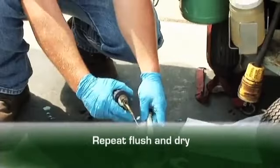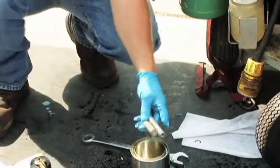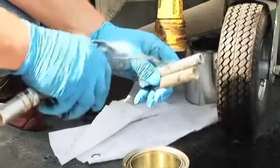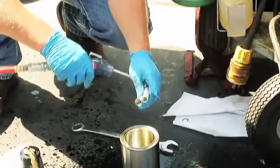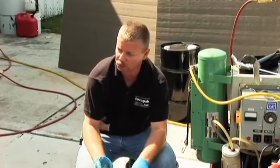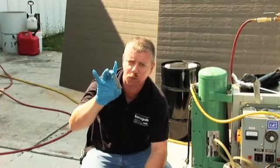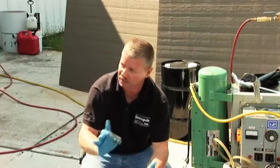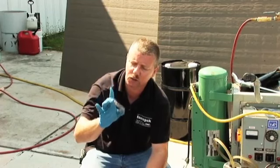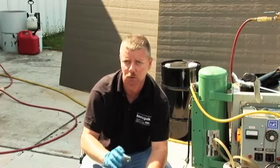We're going to repeat that procedure — flushing and blowing dry — twice to get as much residue off as we can. After cleaning the screens by flushing and blowing dry twice, we want to look at the screen in the light to make sure it's actually clear. Sometimes a varnish can form on these screens — they look clean in your hand but can be completely clogged. A little bit of debris is all right. As long as the screen is at least 80% clear, we're fine and can use it again.